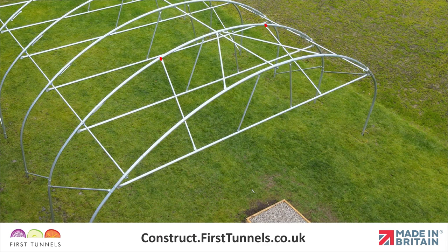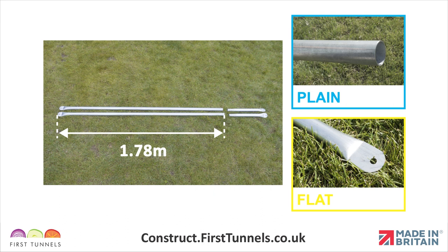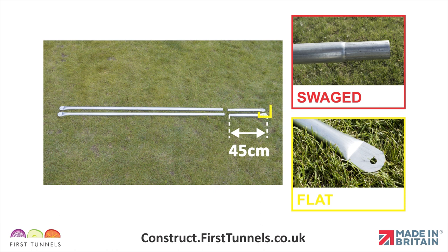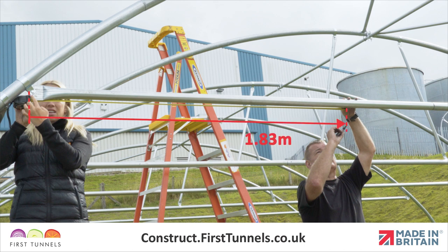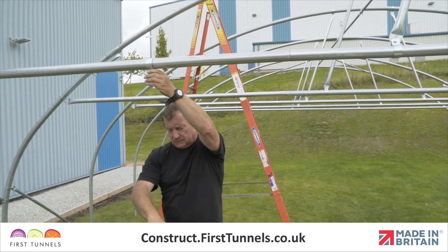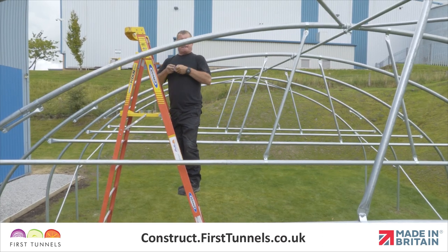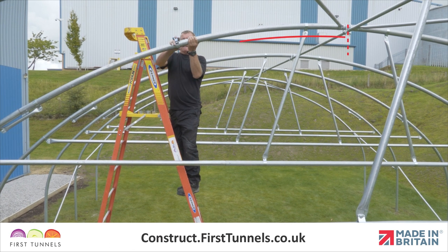We will fit the door rail stabilisers. Door rail stabilisers span from the door rail to the first intermediate hoop. There are two door rail stabilisers per end. They are supplied in two pieces: one is 1.78 metres long and is flat at one end and plain at the other end; the second is 45 centimetres long, flat at one end and swaged at the opposite end. From the end of the door rail, measure 1.83 metres in and make a mark. Fit a Q-clip at this point, positioned so that they don't interfere with the doorpost timbers. Now fit a Q-clip onto the first intermediate hoop, approximately 2 metres from the ridge clamp.